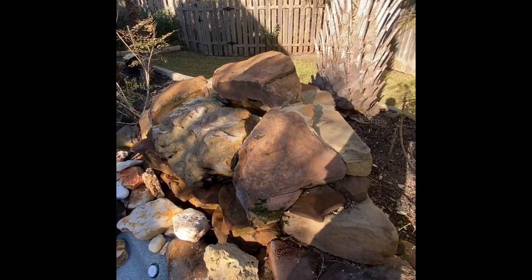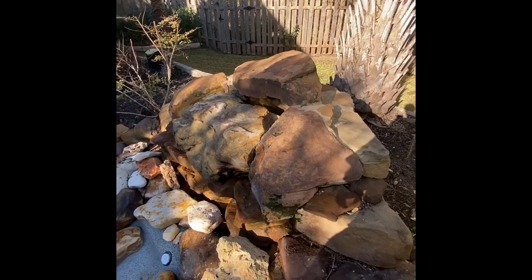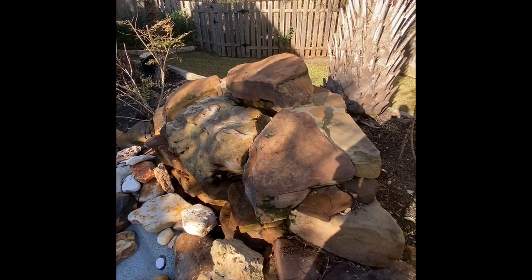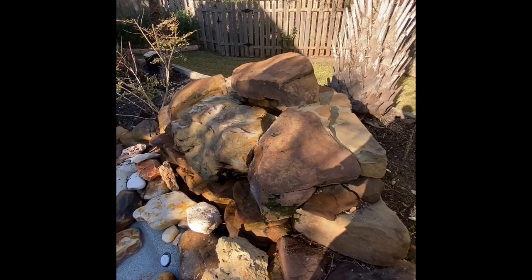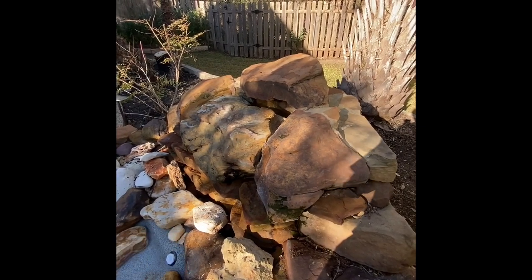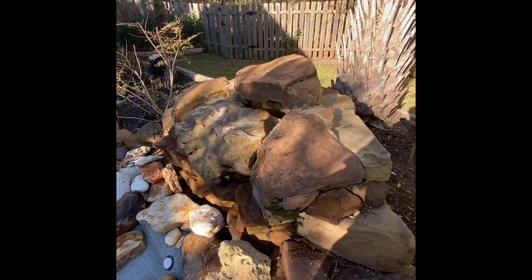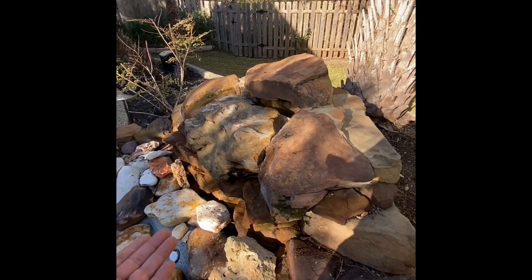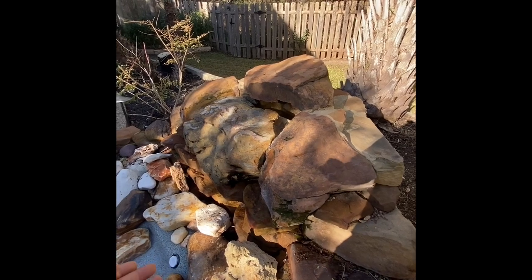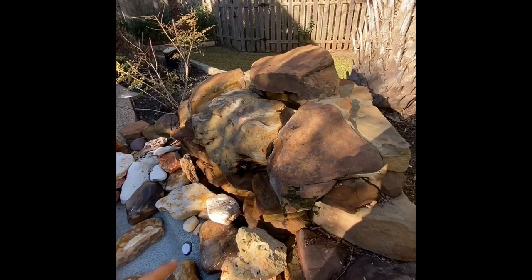But while we were here, we were discussing with the pool company, and the pool company noticed that there was a light right about there. You can see it, and you see all these boulders. So there was a light there before, and he noticed that the light had been broken from its threading, right? Since it was broken, it was plastic, the water level would rise, they would fill it up again, it would be right about there, and the water would just drip right out, right? So that's how they noticed the water was leaking. Now since they put the cap on, it hasn't been leaking.